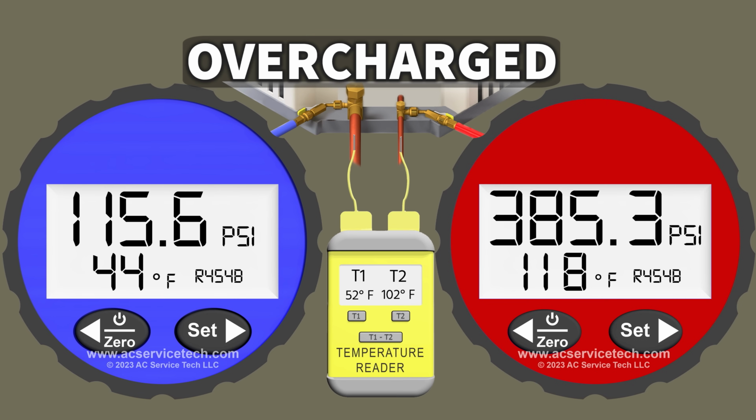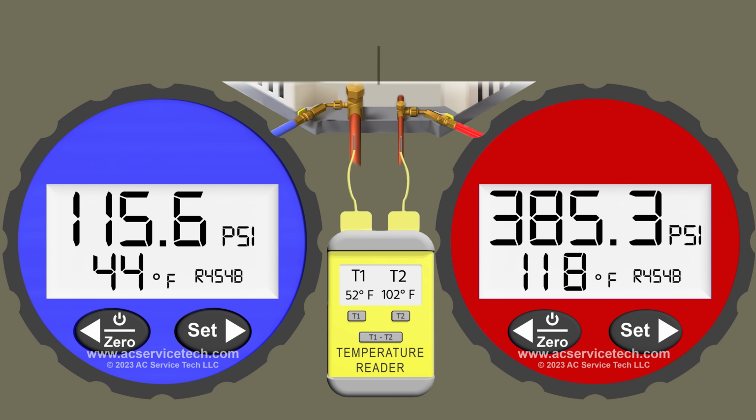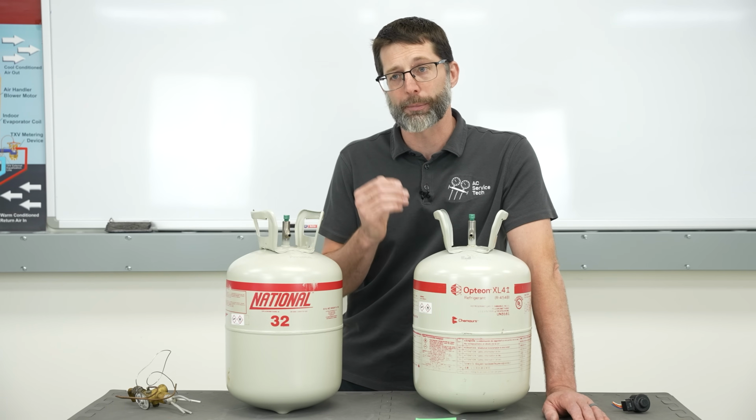Likewise, over at the indoor coil, we measure a saturated temperature of 44 degrees and a vapor line temperature of 52. So we take 52 minus 44, and we're left with 8 degrees of total superheat. So we actually have just too much refrigerant in the system presently, and so we need to recover a little bit of refrigerant out of the system, and so that's going to reduce the subcooling to a proper amount.